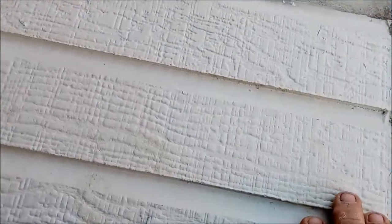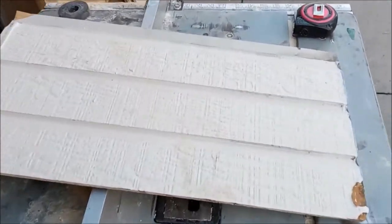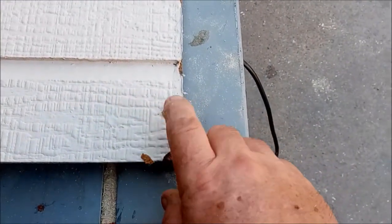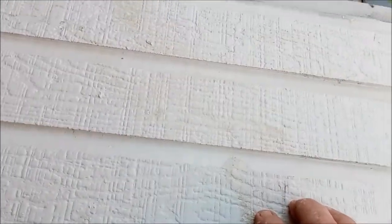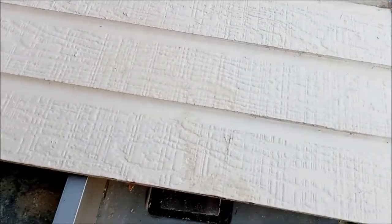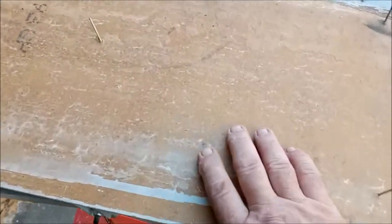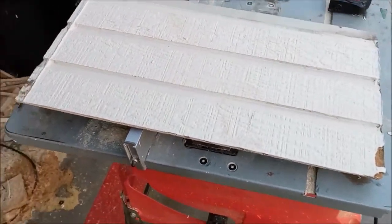You can't get this anymore. There were a few class-action lawsuits because of this stuff. The problem was, if you got a little chip in it and water intrusion, the siding would rot out - then you had a termite problem or a carpenter ant problem. Also, if it caught fire it would just go right up - very flammable. So after the mid-to-early 90s they stopped using it, and now you can't find it or find an exact replacement.